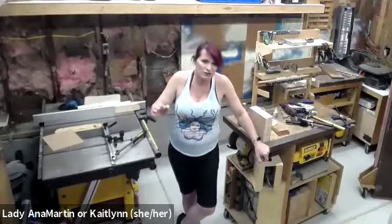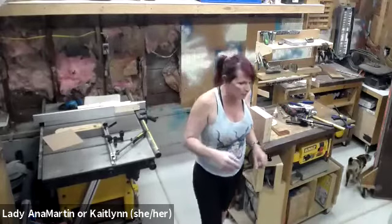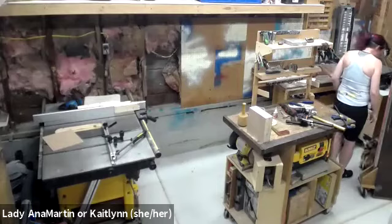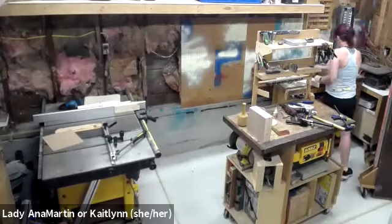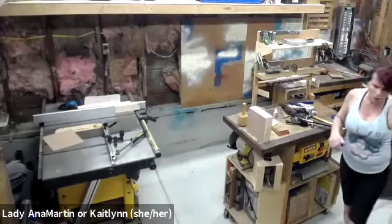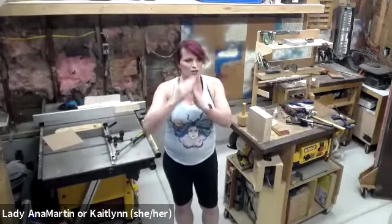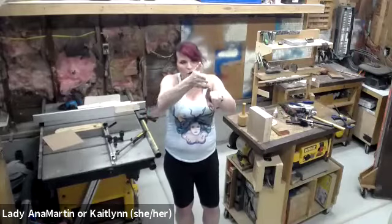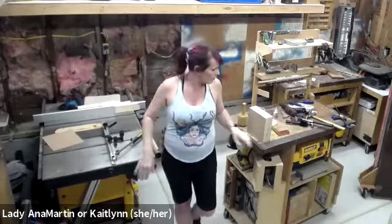If you make a pencil line, then the ability to cut on half of that pencil line is huge. Somewhere in here, I have a marking knife, which is also something very useful for what we're doing. But I put it someplace where I don't know where it is. A marking knife is a knife that's beveled just on one side. And so when you drag it along your straight edge, the mark that it leaves is flush right up against the straight edge. It doesn't wander at all.